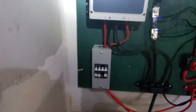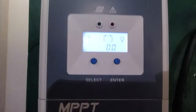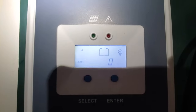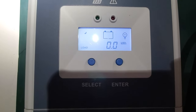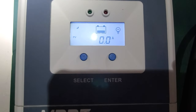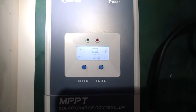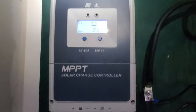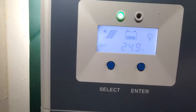The first thing I'm going to do is turn on the breaker for the battery bank and see what my charge controller does. Okay, it came on. Let it get set up — it has some juice in the battery. Now I'm going to flip the 20-amp breaker on, and hopefully that green light comes on, showing it's getting some kind of a charge. The batteries are at 26 volts right now. Getting a flashing green — they're connected. Look at that, nothing tripped.